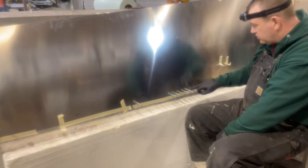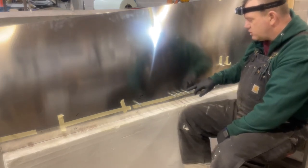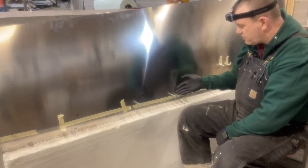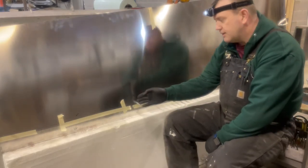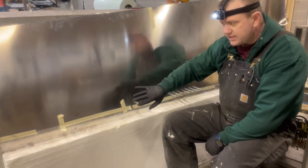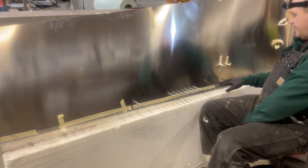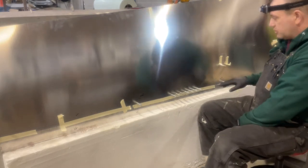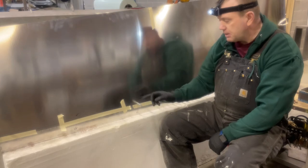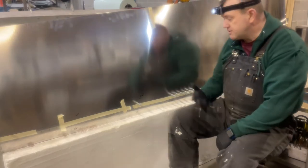I'll go inch and a half from there, measuring from here. There's a little bit of a difference - just a little bit shy or a little heavy of an inch and a half - but that difference isn't huge. So basically I start on each rib, go inch and a half. I've already marked these, inch and a half all the way out to rib number six. If that hole is right where it needs to be, I'll leave the skin up and drill those as well. I'll drill through here. Now that I've got these in, everything clamped and taped, I'm going to pull these rivets that allow the skin to push in as I tighten it down with the rivets as I move out.